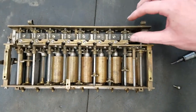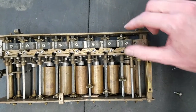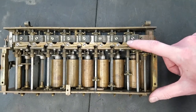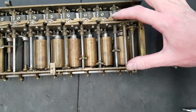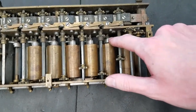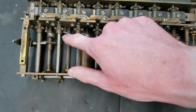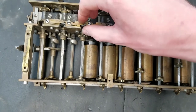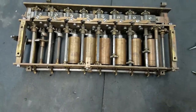These are the carry trips. Whenever a carry happens, this will push this down. And what that does is there's going to be a little finger here — you can see the finger here — so this finger, when the carry trip happens, engages with the gear in the next column, so when this rotates down it will advance that one position.